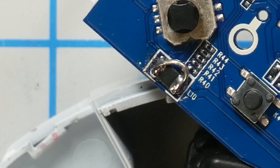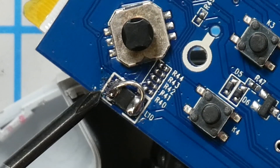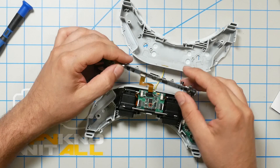Done — you can see we've got a wire crossed and jumpered across the L10 inductor. That completes the L10 inductor mod.